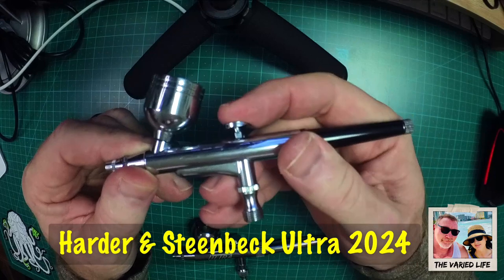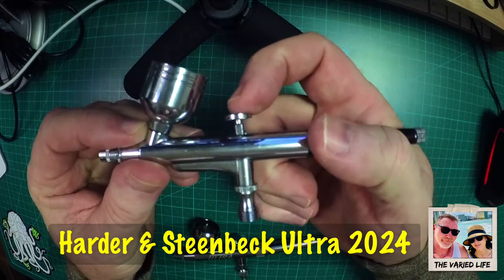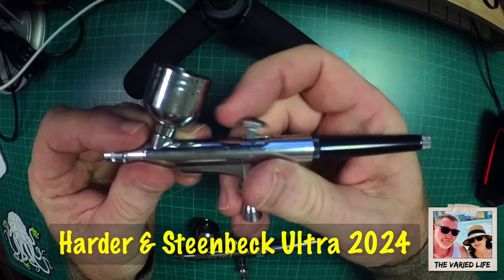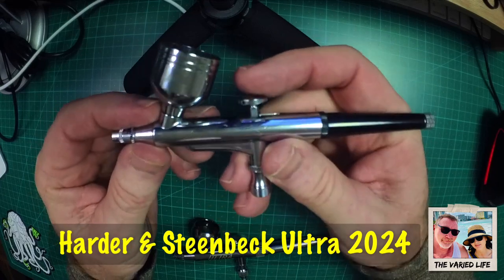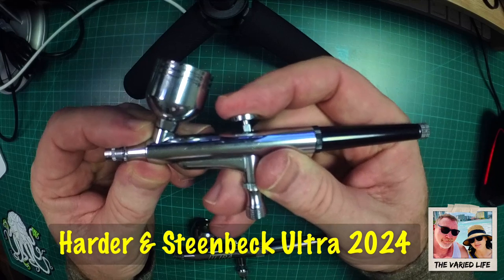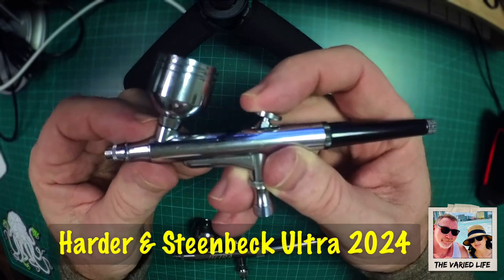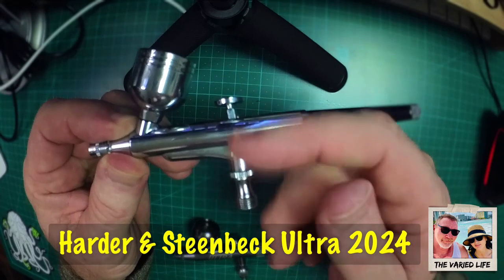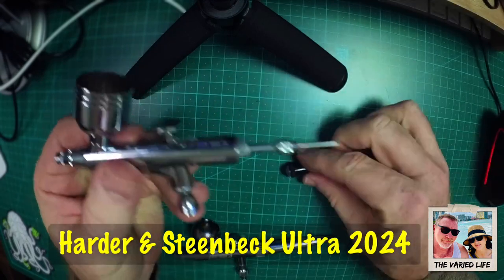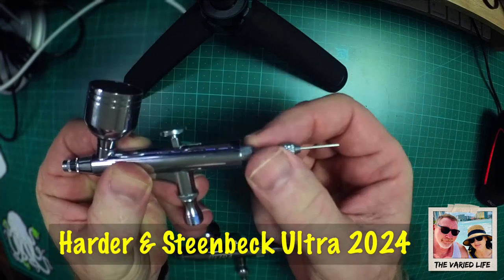The action on the cheap one — here's the thing with this trigger: you can pull it directly back, but what you're supposed to do is push down to activate the air and then pull it back to let the paint in. You never want to go straight to painting. Being a beginning painter, I found this out early watching YouTube videos — you have to make a conscious decision to push down to release the air, get it going, then pull it back to interject the paint into that airstream.